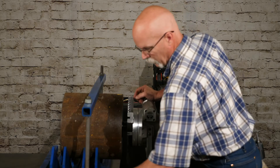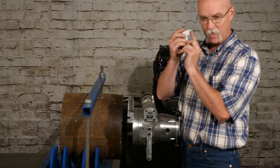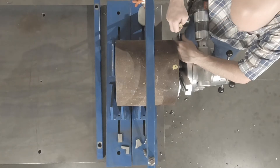Now we can start step cutting. We're doing a 37/10 today — this is the combo bit — and you don't want to try to use this to push the whole prep on at once, especially on this material. What we chose to cut today is either P91 chrome or X70, which is very hard. So we're going to use just a straight 10-degree bit. If you do an individual step, you always want to try to put your bevel bit or any bit in the steel block — we have two aluminum blocks and a steel block.